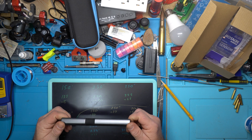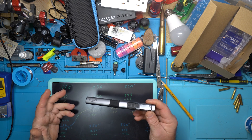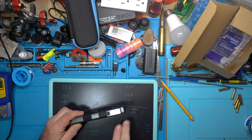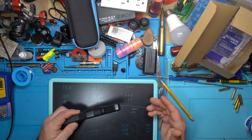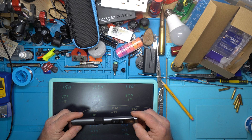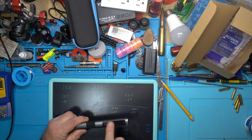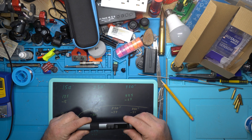The problem was I was setting all the irons default out of the box to 300 degrees Celsius. This one was actually running at about 250 to 275. So it was like taking a racehorse and putting handcuffs on its feet — that's essentially what I was doing in that test, without realizing this iron was not accurate from the display versus the actual temperature.